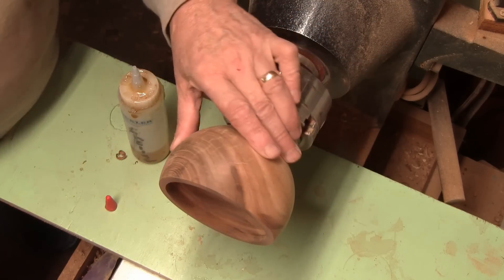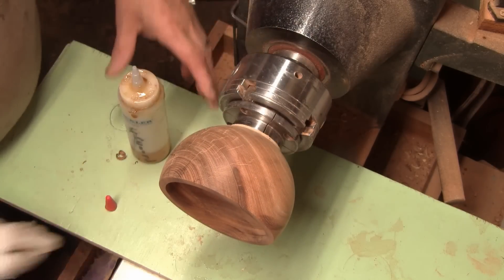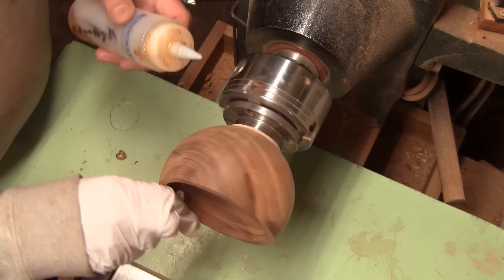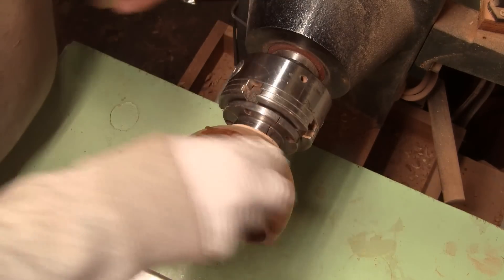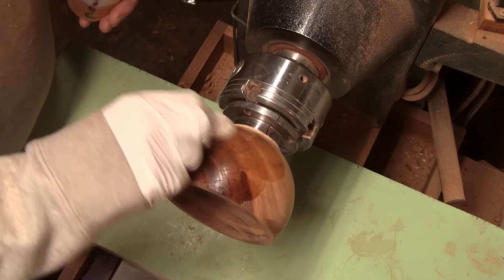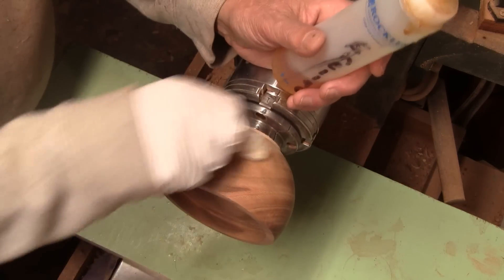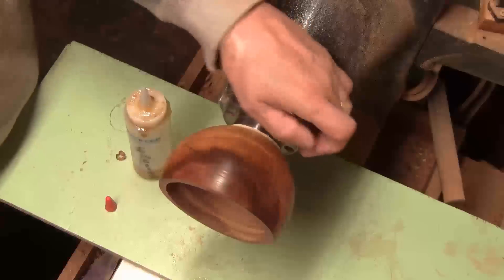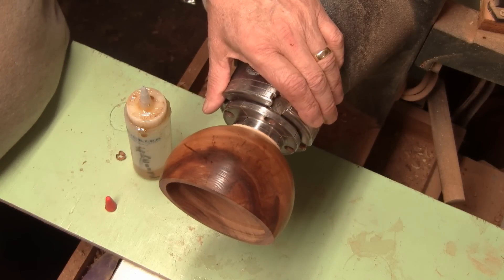I have it a little sanded up, and I wasn't going to put the finish on until I was through, but I can feel these little cracks. I'm kind of hoping that the shellac-based sanding sealer will get in there and allow me to sand it a little bit better. Hopefully it stiffens up those little fuzzies in there. Looks like it actually has filled them — I think this might work. When I come back I should have something set up here to show you what I'm doing, and maybe it will finally make sense.